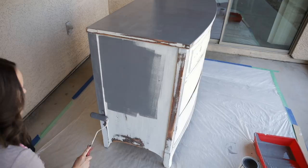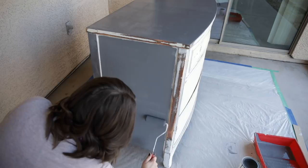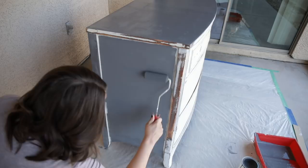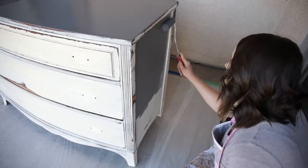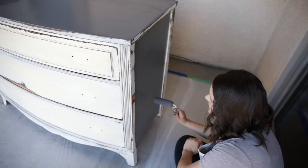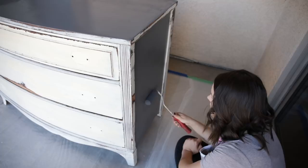You want to be careful not to press your roller down too hard. If you do, it won't roll and it will also leave marks where the paint builds up on the end. So just be careful as you're going that you're paying attention and you aren't leaving roller marks on your dresser. I just lifted a little piece of dirt off the dresser and you could tell it left a scratch mark, so I simply pounced the tip of my roller on that area where the paint came off to cover it. I do the edge pieces last because that way my roller has the least amount of paint on it and it's not going to bunch up on the edge.